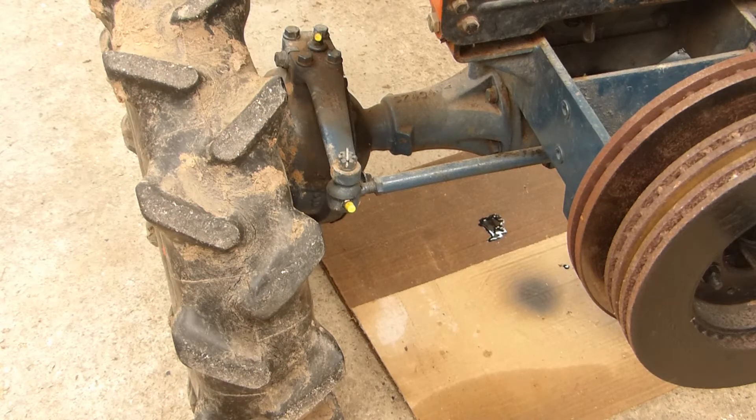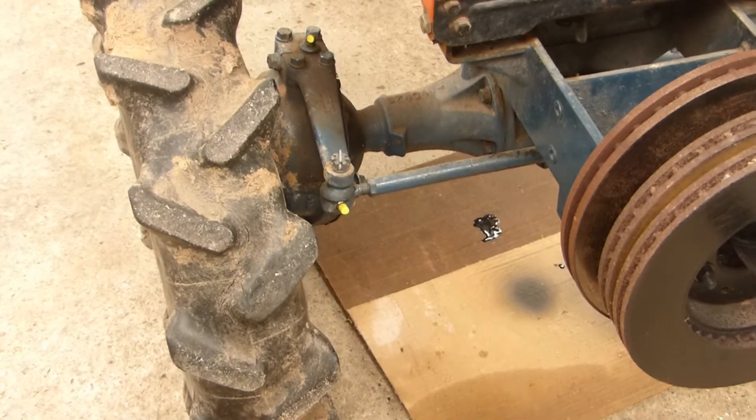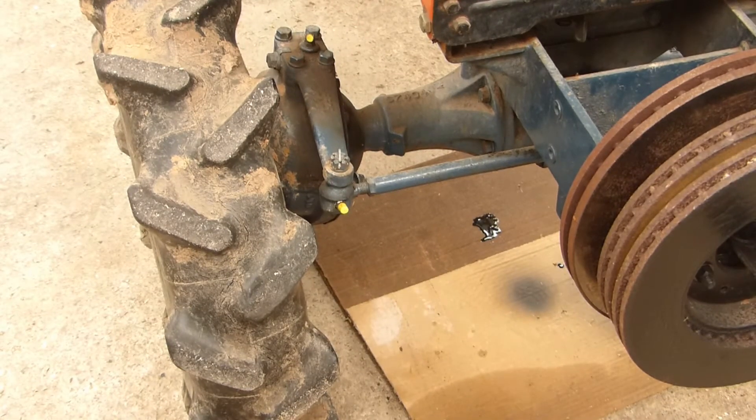Now I just got to check the air pressure in the tires. Got some old printout here — B7100, but more or less the same. So these are Bridgestone Farm tires. The fronts are 11 to 14 PSI, because this is the four wheel drive version, and the rears are 17 to 23 PSI.